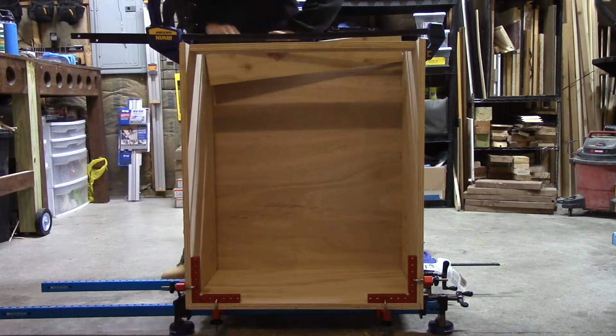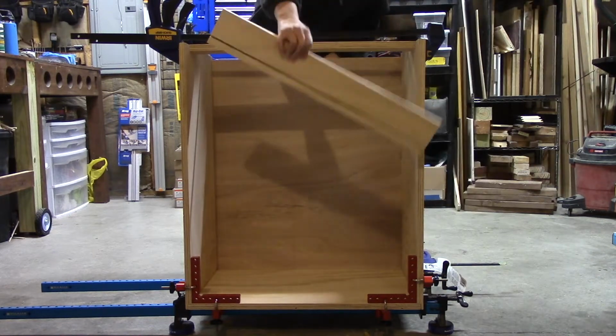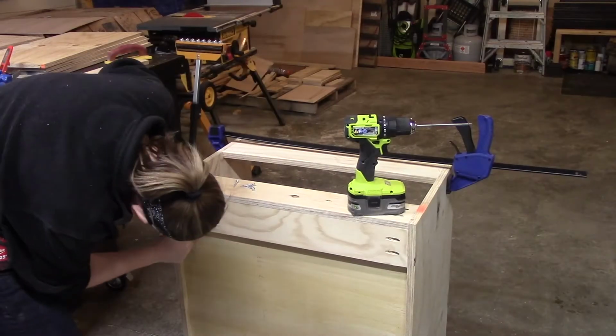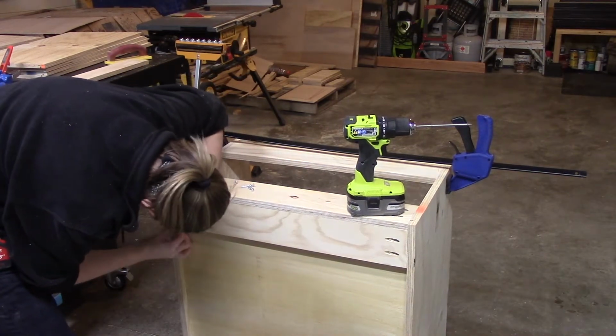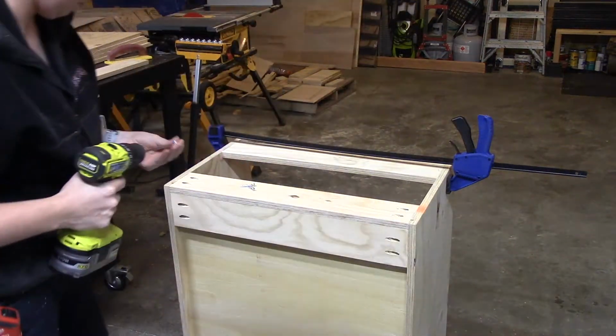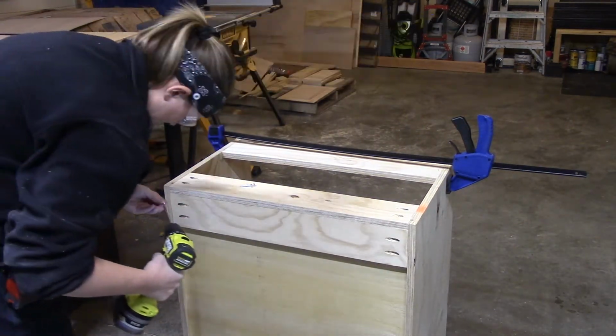And now you're going to find that 4-inch strip that you cut the groove in, and you're going to place it on top of that panel and screw it in using the pocket holes. You're going to grab another one of those strips and install it right underneath that. This piece will be used for mounting your cabinet to your wall when it's lined up to the studs.